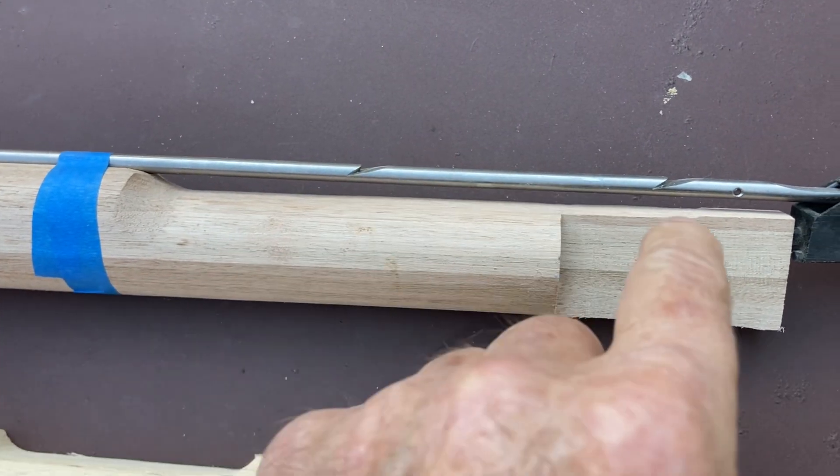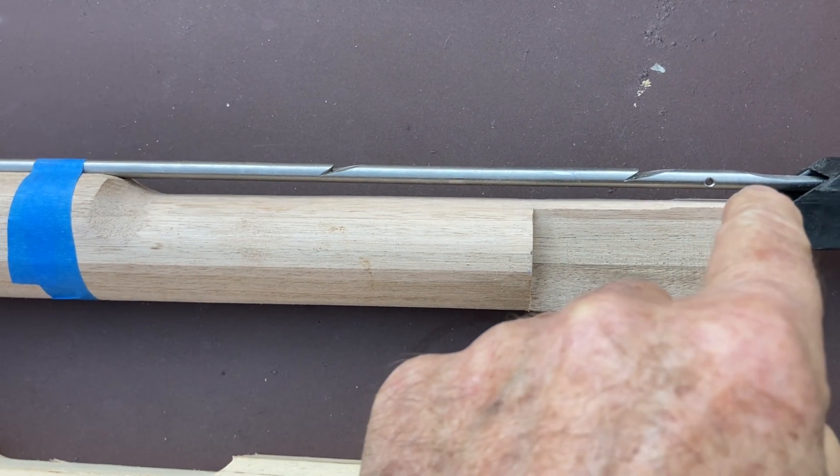So now I have the stock. It's rounded, it has an elevated spear channel, and it has tenons for joints on the ends. This isn't everything I'm going to do to the stock — later on I'm going to put some supports in there underneath the spear where the vital cut goes, and also closer to the trigger mechanism, but that's for later. There'll be more videos in this series: one will cover the muzzle plate, and another will cover the combination of handle, trigger mechanism, and butt piece.